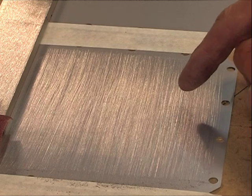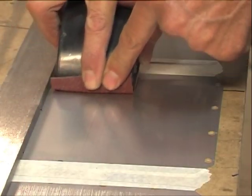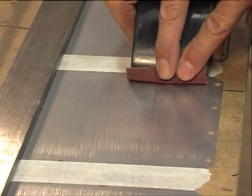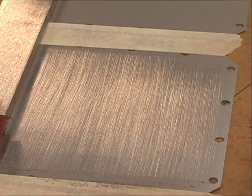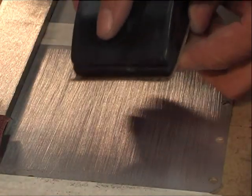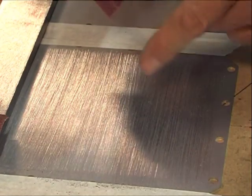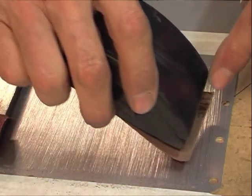This plate is being crosshatched. I'll show the process on a new plate. I lift it here and I go back and go down. Now I have scratched it only in one direction. I always use just a completely fresh surface. The new grinding material cuts very deep into the metal. Since this is the upward side, I crosshatch it.